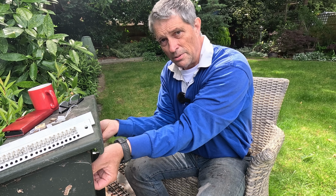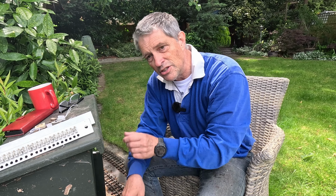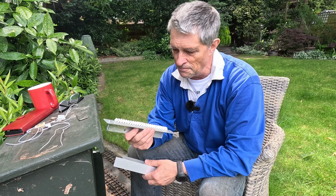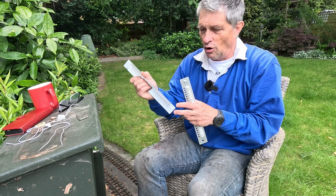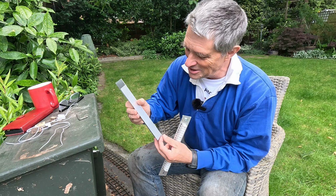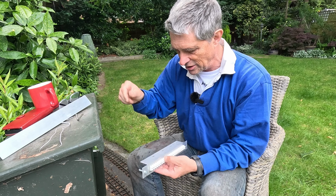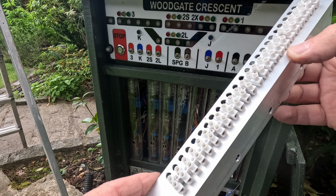I won't bother doing up those bolts fully at the moment. Right, I said I was replacing the narrow strips of aluminium down in the lower junction box area with these wider pieces. All I do is cut off very long strips of angle aluminium, cut these little corners out, drill holes for mounting, etc. That's my template actually, and other cable strap points and holes for wires.